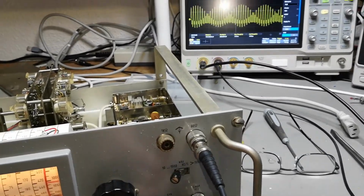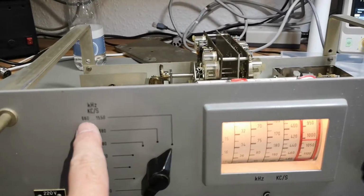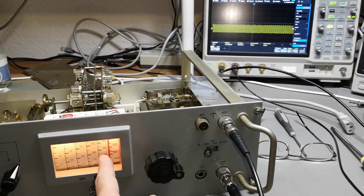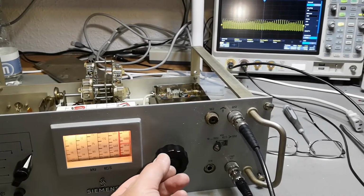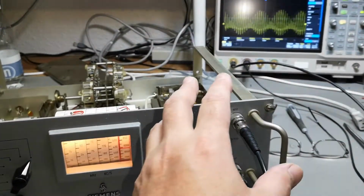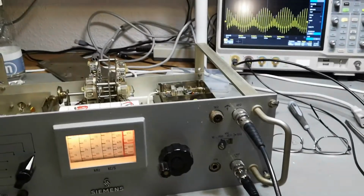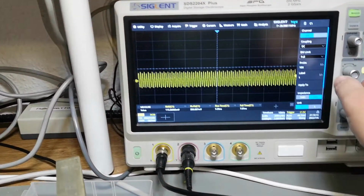So this is 1 megahertz of very, very little signal. So then I go to the converter. And now I need to select this range. Okay? So here's 1 megahertz. So look what happens when I dial. Ooh, now I'm gone. So you see what happens? Then I go to 1 megahertz. Ooh, I get a lot of signal. So this is a mixed signal with the 20 megahertz carrier and my 1 megahertz. It is converted now into a 20 megahertz. See, if I turn off my 1 megahertz, then I get this weak signal here.